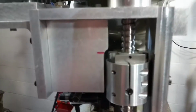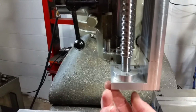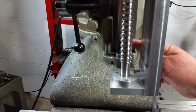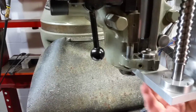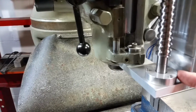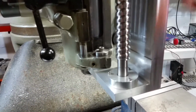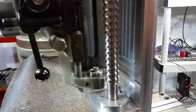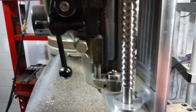And then here we had, I don't know if that's 1/2 inch or something I used, and mounted it down into the bottom of the casting here, and brought it out, a bearing mounted here. And this is basically just to keep it rigid, because I saw it flexing, so I knew right off we had to do something more for that.